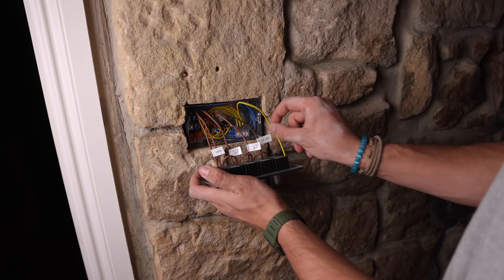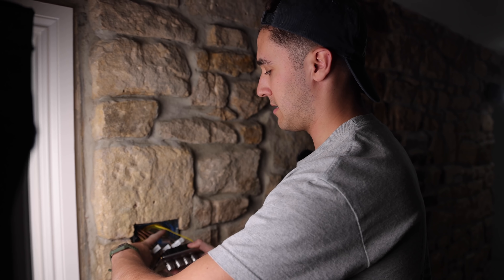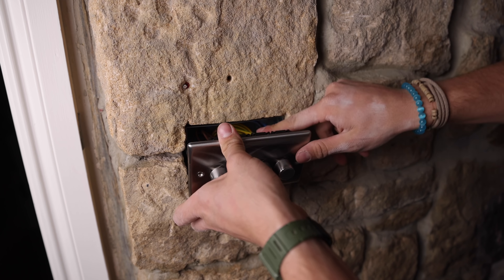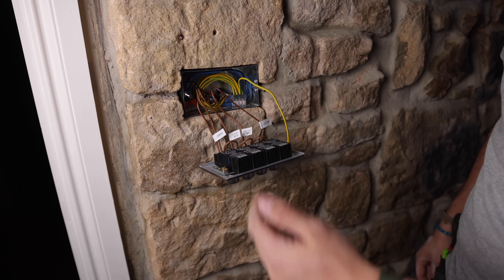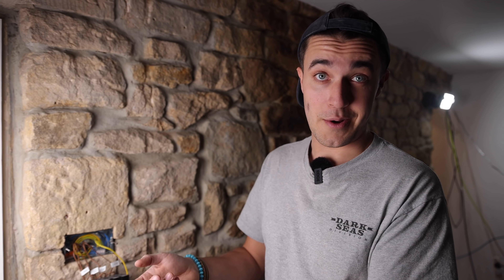So this is all labeled up now — just makes it a bit easier for someone working in here in the future. There's no need to have messy switches even when they're really busy. I'm just going to bend it back and push it in like so, dressing it in as I push it — nice smooth bends on the cable so nothing is forced. And there we have it, that's our switch. Annoyingly, the British General dimmer modules are absolutely trash and are just flickering with these lights, so the guy tomorrow will bring some decent ones from his wholesaler. That is all for today — I think we've got all the lights on, kind of. We had a wicked little skate. Subscribe, thumbs up, and I'll see you on the next one.